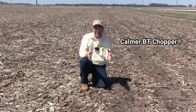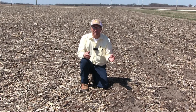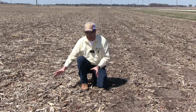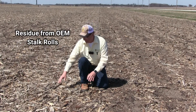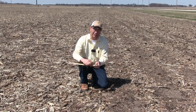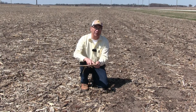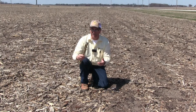I am kneeled down here on the dividing line from where we harvested last fall. Visually, it's easy to see. Here's the knife-to-knife or the original equipment from the factory — you can see the longer stalks. You can definitely see that this was knife-to-knife or tip-to-tip because about every three and three-quarters inches, there's a spot where the knives have chewed into the side of the stalk.